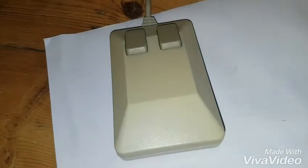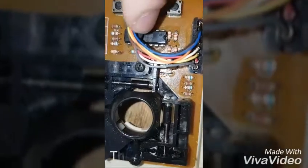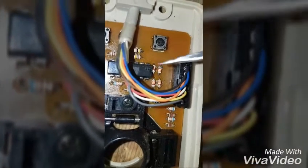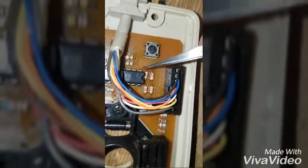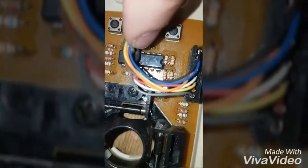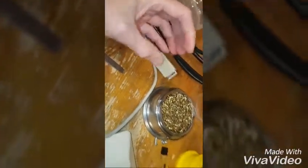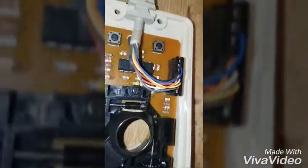What I wanted to do was make sure I didn't mess up my mouse. Luckily there's a chip in there — if you get the pinout of that chip, which you won't need to do because I already have, you'll find that with the nick at the top as orientation: the third pin down on the right is ground, and the third pin down on the left is VCC, or 5 volts. So third pin down on one side is VCC, third pin down on the other is ground, and you can trace that all the way through the cable to work out which pins are VCC and ground. Once you've got that, it doesn't really matter, because as long as you're not cooking this, you can mess around with the others. That was the first thing I did.